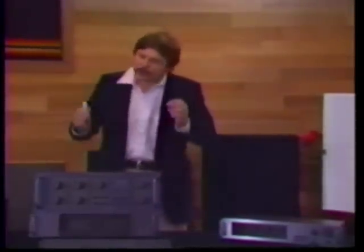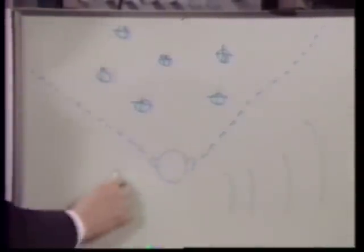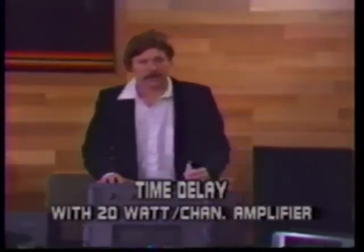That's okay as far as it goes, but what we really want to do is add a perspective that says concert hall. To do that, we have to pay attention to the longer delayed sounds, the sounds that arrive many, many thousandths of a second later. Not millionths of a second, which is the holography, but thousandths of a second. Those are the reverberation and reflected sounds. And these come basically from the side and from the rear. They also come from the front. But they're delayed in time so much that those sound arrivals tell us about the hall. And that is accomplished in this unit by a built-in time delay system. Moving right along,